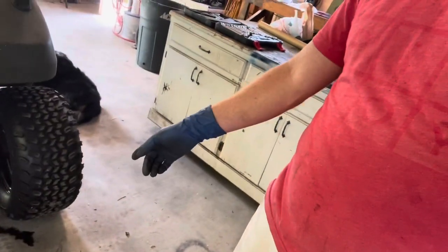Hey guys, thanks for watching In the Shed with Red. Today we've got a new video on the Club Car DS. My son parked it a few months ago and we noticed a lot of oil on the ground. I pulled the motor and replaced the gasket on the side of the clutch — it had a hole in it, easily seen. I didn't do a video when I pulled the motor then.